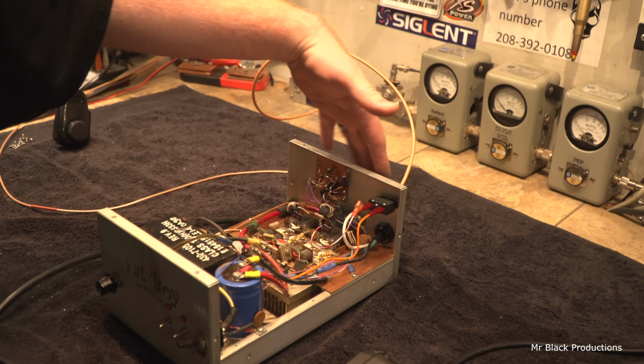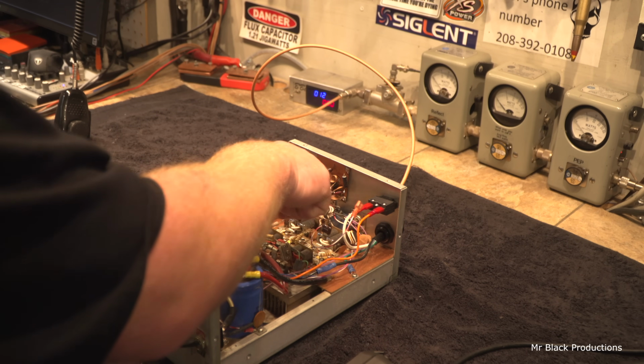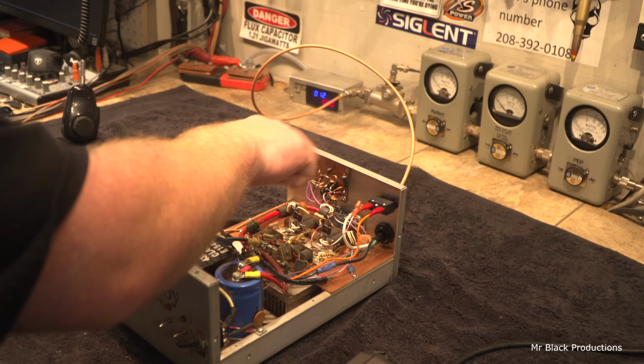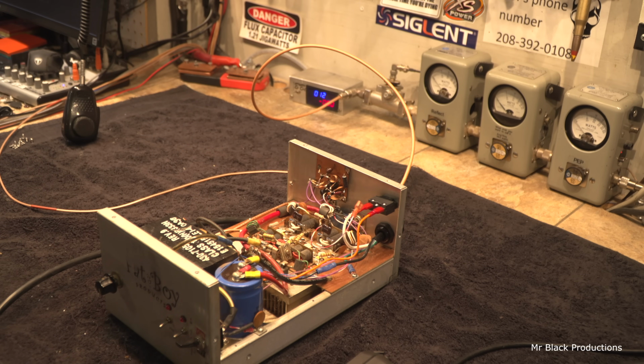And the measure of resistance of just this here. And usually it has something to do with this preamp circuit. There's a huge impedance bump that takes place right here, and people get fixated on just making the preamp work, and they don't want to take care of the impedance bump that's here. I'm sorry. If I'm putting 5 in and getting 2 back, that's like an SWR of 3.5. 4.4, 4.25 something. I got a chart around here someplace. There it is.